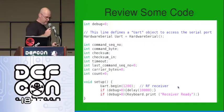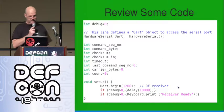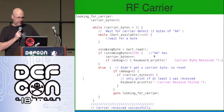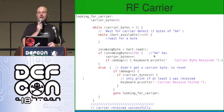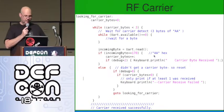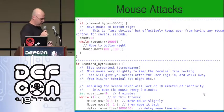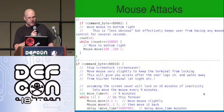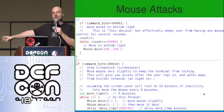Just to give you some idea of what the code looks like: you've got integers, it does floating point math — I don't have to write a multiply instruction, that's just awesome. For the RF carrier here on the receiver side, it's looking for three or more bytes of 0xAA — that's identifying the upcoming frame. When it finds it, it recognizes that the frame's coming. Here's the actual code that executes the attacks. The first example is this mouse DOS kind of attack — basically it just moves the mouse to the bottom right of the screen, keeps moving it down and right continuously. And it does it faster than you can move it.